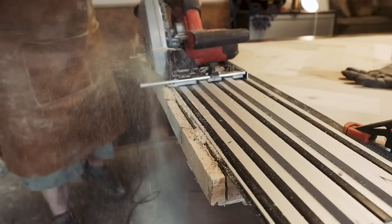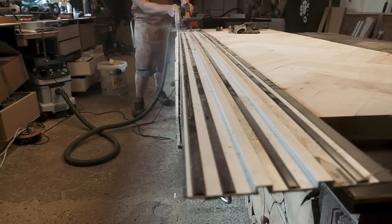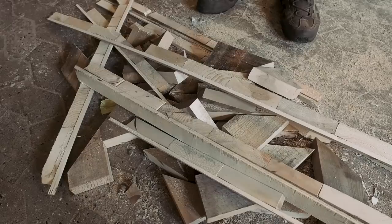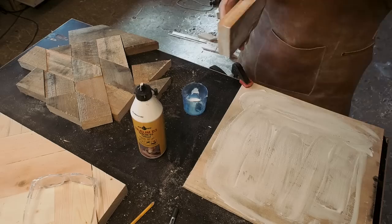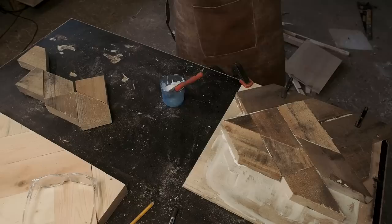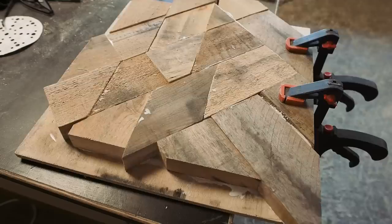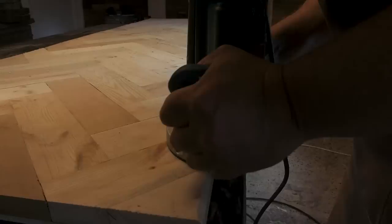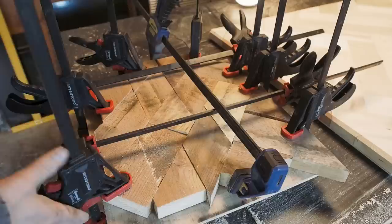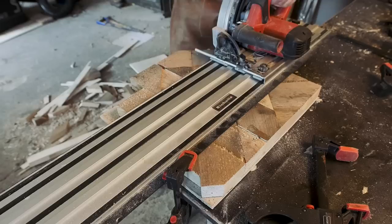I remember my boss wanted a small table or shelf by the bed, and I'm thinking of a creative way to make one. I have run out of full-length pallet boards, but wait — I have all these offcuts. While that dries, I'm giving the headboard a little chamfer. When the shelf is dry, I run it through the thicknesser a few times and cut it to size with a track saw.